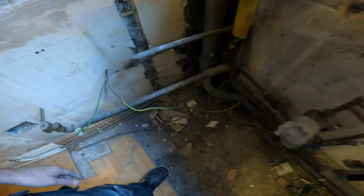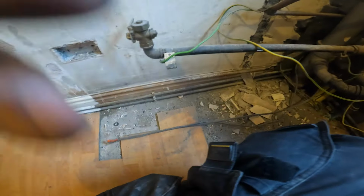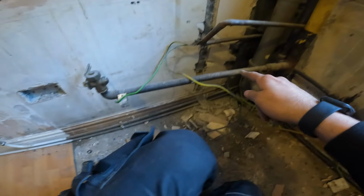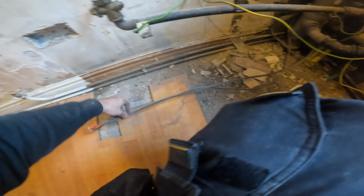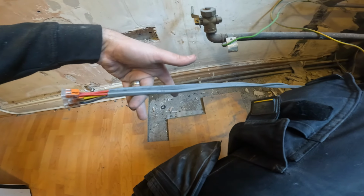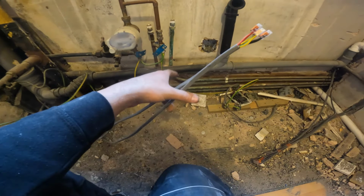And then for this side, we're going to do the same. Extend the ring, so this is the ring. But this time we're going to send a cable from here out for this cupboard, back, up the wall, and then back. And then do the same thing, so just tape it next to it, and when it comes to it, we'll split that, extend the ring, and then get it in a little Wago box, tuck it underneath, jobs are good, and that's 30 sockets done.